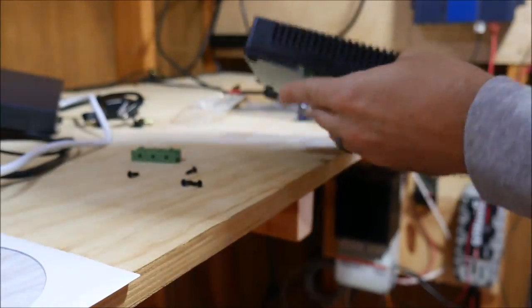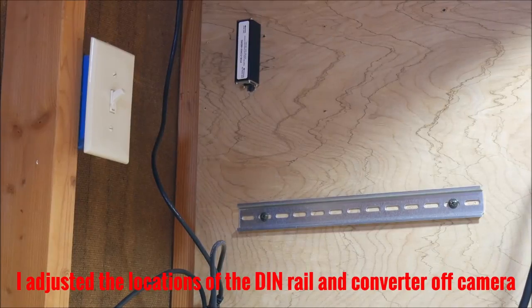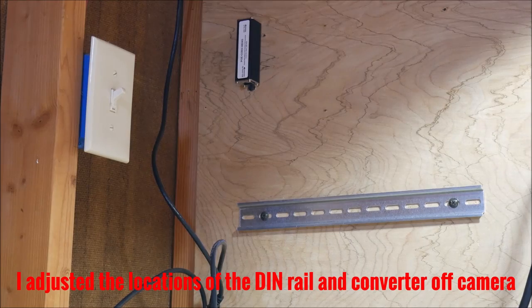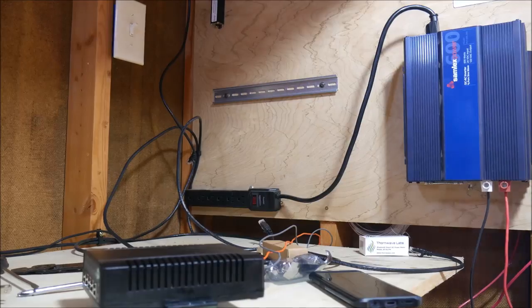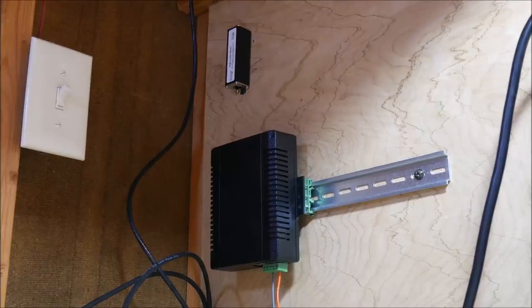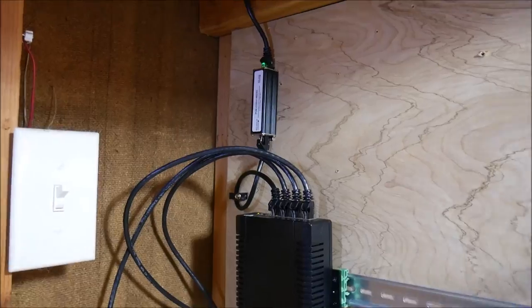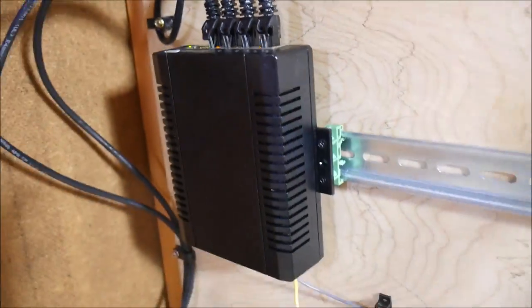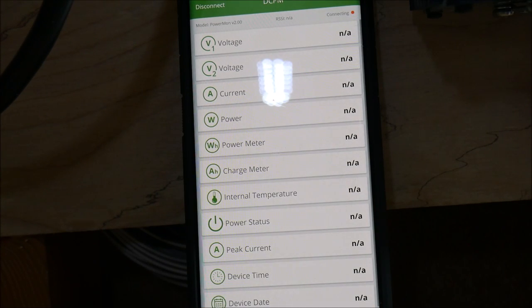The installation of the switch is very easy and straightforward — it just needs small positive and negative wires from your battery bank to the screw terminals on the side. The entire screw terminal assembly slides out of the switch so you can make all your connections a little bit easier. It also allows you to unplug the switch quickly and easily without any tools if you need to power cycle it. All that's left is to connect Ethernet cables between the various devices, reconnecting the cables from the previous setup.